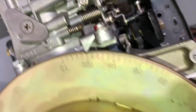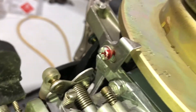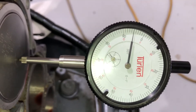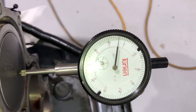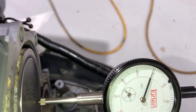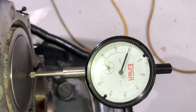We're going to center on the flywheel, and the way we check that is with a dial indicator. This indicator right here has a screw — it is adjustable, it has a slide on it — and it's very important we get this set at top dead center. So we're going to rotate this motor and watch this dial indicator. We went past top dead center, let's go back, and our needle has stopped moving.